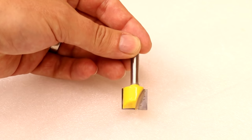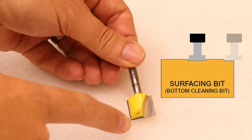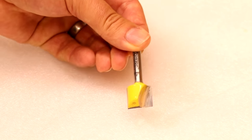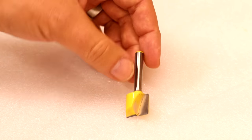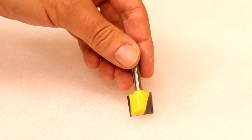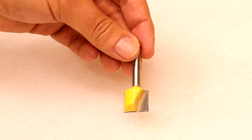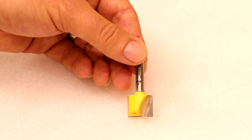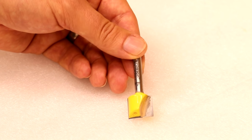The last bit I'm going to mention is a surfacing bit, also known as a bottom cleaning bit. It is extremely wide on the bottom. For CNC purposes, these usually only get used when surfacing a spoil board, and you have to take them quite shallow because going deep requires a lot of pressure and torque that these machines typically don't have. Whilst you won't use these very often, it's a good tool to have in your collection — brilliant for surfacing spoil boards and making sure surfaces are completely flat.